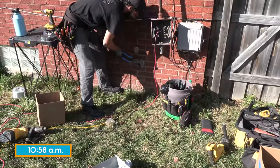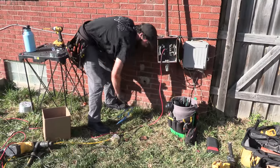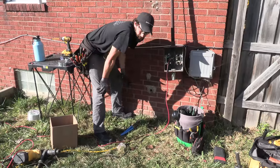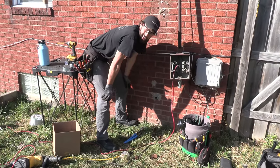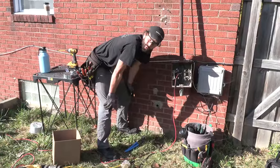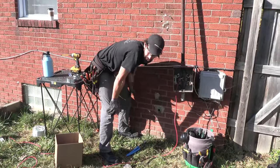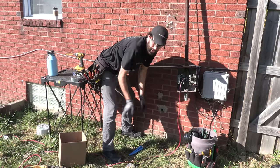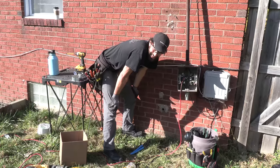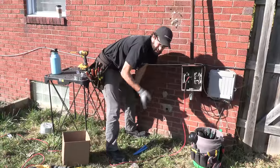It's currently 10:58. We've got the panel downstairs taken apart, and we've got two more things to do today. We need to go do a billboard inspection. There are power requirements. See, a digital billboard face pulls quite a bit of juice, and it costs $250,000. And this billboard's getting two new digital faces. It's going from static to digital. And I believe it's underserved and needs branch circuits to pull 60, I believe. 120, 240, 2-pole 60 up to each billboard face.